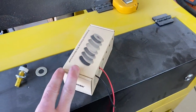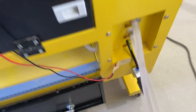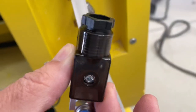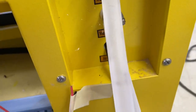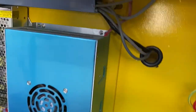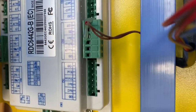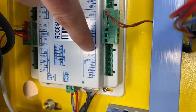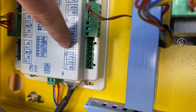Now I've got my box of wire ready and all I'm going to be using is red and black, because there are two poles on this solenoid. We can actually unscrew the cap so we can screw those in. The wires will come out and I just have to figure out how much wire I need, because the wire is going to travel through that hole with everything else. Then there's all these wires back here that are tucked in, going all the way back through this hole into the electronics. It's going to run across there and then down to where the controller is. We are going to wire into the 24 volt and wind — those are the two that need to be done. I've got some of these little connectors that we're going to use.